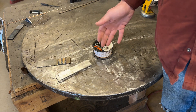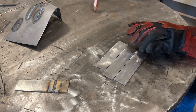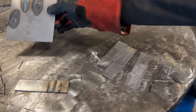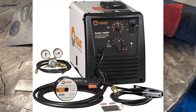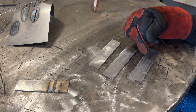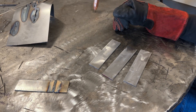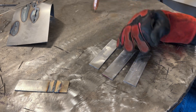I'll be honest, I have no idea if it's possible but we're definitely going to find out in this video. For setup I've got eighth-inch or 3.2 millimeter steel, and I also got some sheet metal we'll be trying later. My machine recommends 20 volts and about 450 inches per minute wire speed for this material, so he would definitely be able to weld eighth inch — but we're going to see how thin we can go as well.